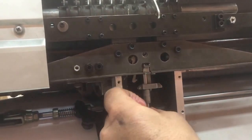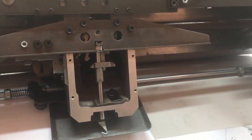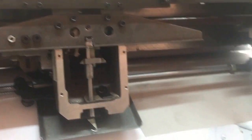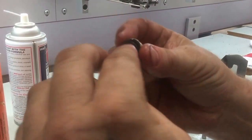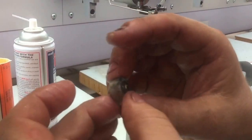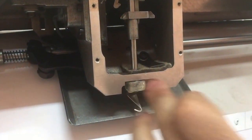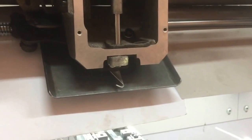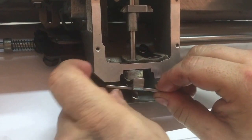Okay, from here we're going to bring our bottom foot roller in, and this is what holds the bottom of the needle assembly in place. The whole needle assembly slides left and right for colour changes. I've got witness marks on there to say which way up that's meant to be from before. And then this is just attached with a couple of Allen bolts on the bottom.